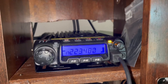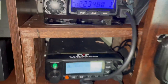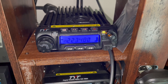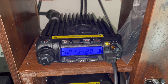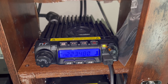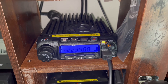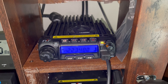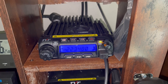I caught you guys and was moving the antenna around while Mike was talking. I got a very strong signal — about four bars — pointing almost just a little east of north, kind of a more direct path. When we dropped down to the 4-8 frequency his signal was still copyable but dropped in strength. Now the antenna is pointed about due southeast and I'm getting fluctuating between 3 and 4 bars. Mike was definitely stronger on the 500 heading. It's working — copying him very solid, running about 20 watts.